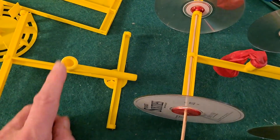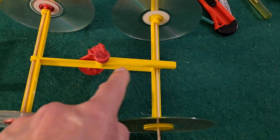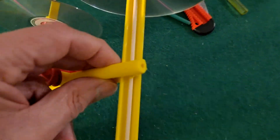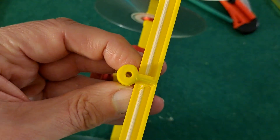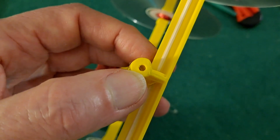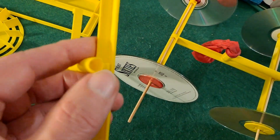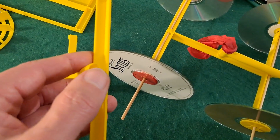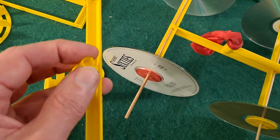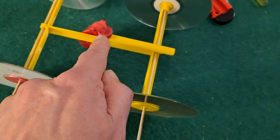Version one was just a straight pipe down, straight pipe along. This one is actually a proper curve, so we've got airflow around there, and then this pipe tapers to the end and we've got quite a small nozzle — about three millimetres. That's a bit rough around the edges now, but yeah, about a three millimetre exit hole, whereas version one is about an eight millimetre exit hole. I put a restrictor in there but it was just a straight thinner tube in the end of it, and that slowed it down. I think part of that was it would have been messing up the airflow, so this one's all smooth.